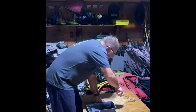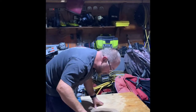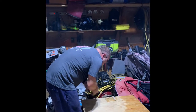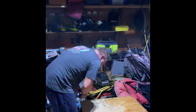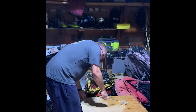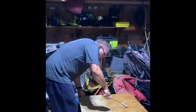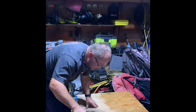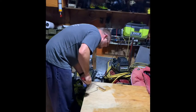Hey folks, welcome back to Malastokade. Just in the process of treating the plywood for the boat floor that we were working on. This is 100% fiberglass resin, not thinned. I was going to thin it initially and decided not to — not sure if that's a good idea, we'll see how it works. Other than enjoying the fiberglass fumes here, we're getting this done.